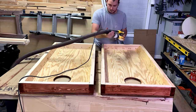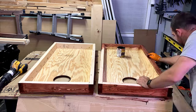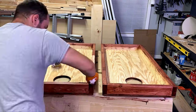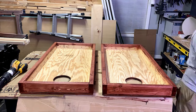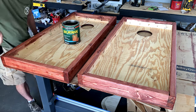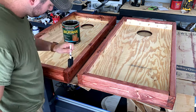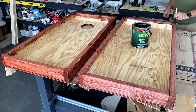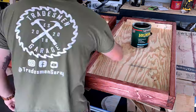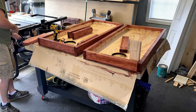I went back to the boards, sanded the bottoms down and prepped them for stain. Stained them just enough to get a good color visible from each angle — not really worried about the bottoms — and let those dry overnight. The new urethane is really sticky and tacky, nothing like what I was using before, but it does the trick — just takes a little longer to dry. I put about two to three coats on the underside of these.